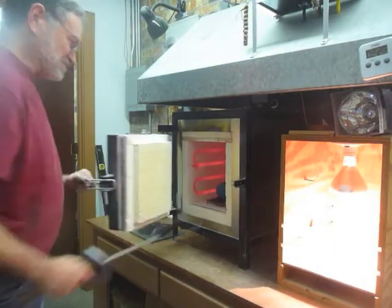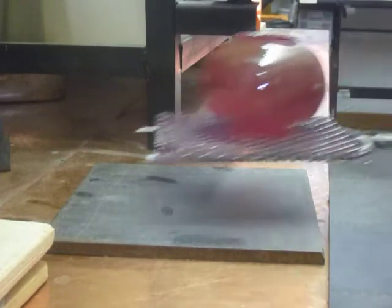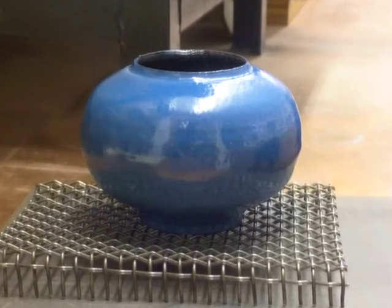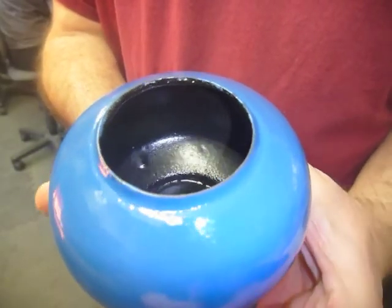If I leave it in the kiln for too long, the enamel will get too hot and burn or drip off on the surface. If I don't leave it in the kiln for long enough, the enamel will come out looking rough and grainy. Once removing our vessel from the kiln, leave it alone for at least 10 minutes before handling it again. In the next video, I'm going to explain applying silver foil over the base coat and setting the silver cloisonne wire onto the vessel's surface.